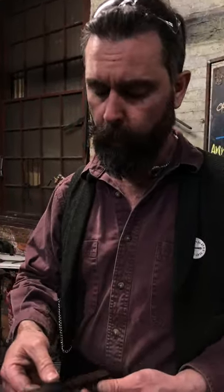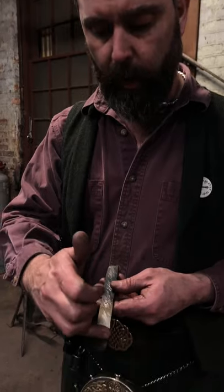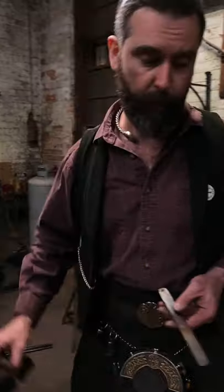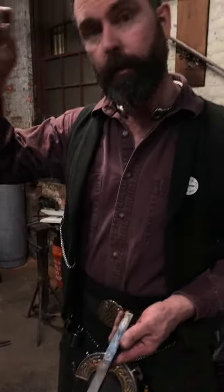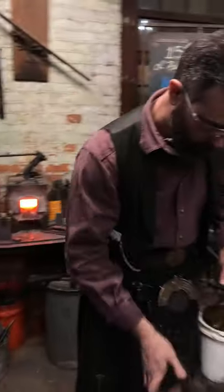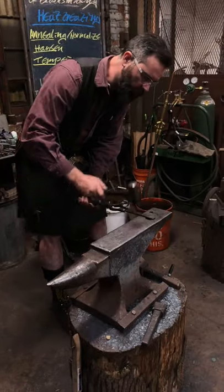I could do a secondary pass on it as well to get that to convert better all the way through. I'm not going to. What I would like to try though is breaking it. So I'd like to try breaking it here in the silver area where it didn't essentially get any temper at all. And then maybe down in the brown, maybe into the blue, see if things fail. So hopefully this doesn't get too exciting. So first off in the non-tempered zone.